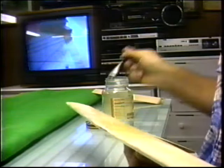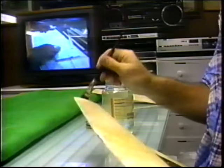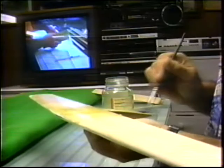And nothing is really more frustrating than, and everybody knows what it feels like, you pull up the masking tape, bingo! And the paint comes up. It delaminates either between the layers of paint or right off the wood. When paint delaminates, it almost always delaminates because you don't have enough thinner in the paint, or because you put the paint on and let it dry, a year in between or something. You don't get a chemical bond.